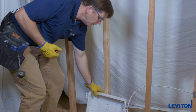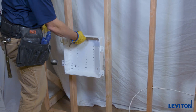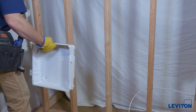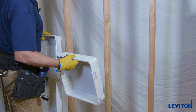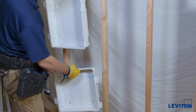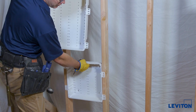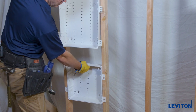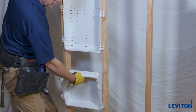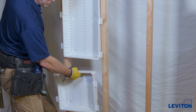We're going to be installing this 14 inch enclosure on the bottom and this 28 inch enclosure above it. There are a couple of reasons you might want to use these two enclosures. If you wanted to put the service provider equipment that needed to be secured in the one below and the residential equipment above, this provides a secured location below and a pass-through using that tube.